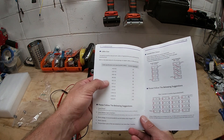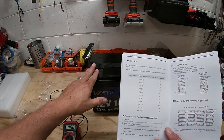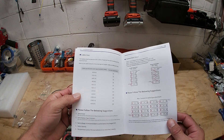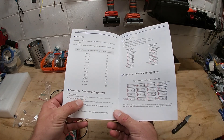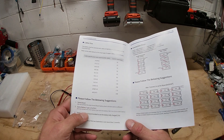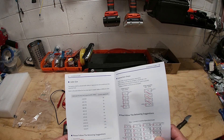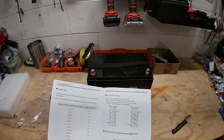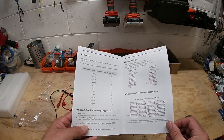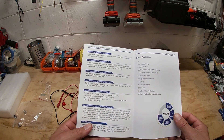There's actually a cable size chart in the manual, which is great — when you draw a lot of power you want to make sure you have the right wire sizes. It says to use the same brand, but we're not going to do that. We're going to connect it to a bunch of different brands. If you've ever watched the Off-Grid Garage, you know you can connect different manufacturers and BMS systems together as long as you keep everything balanced.